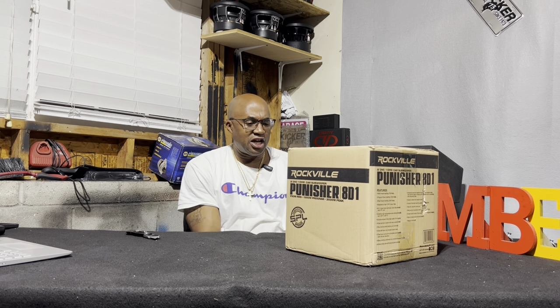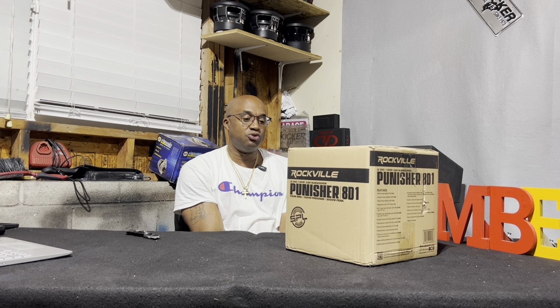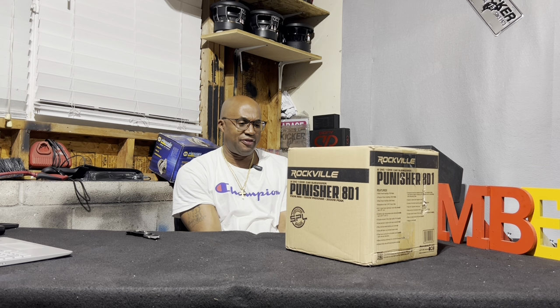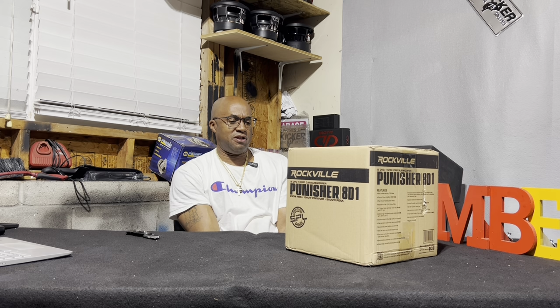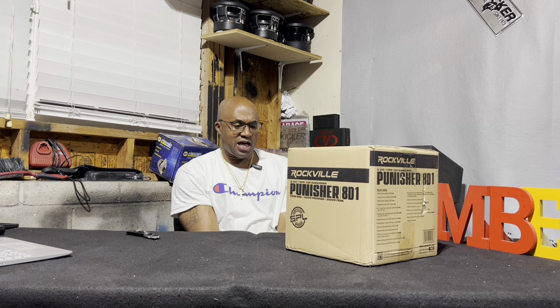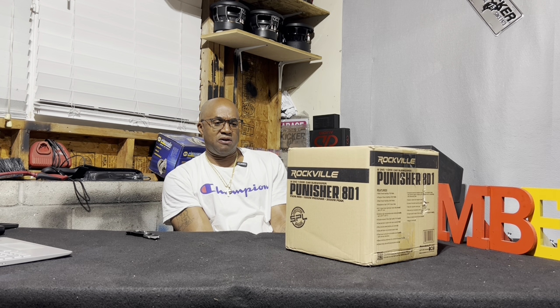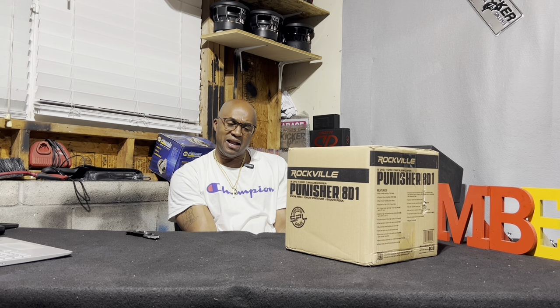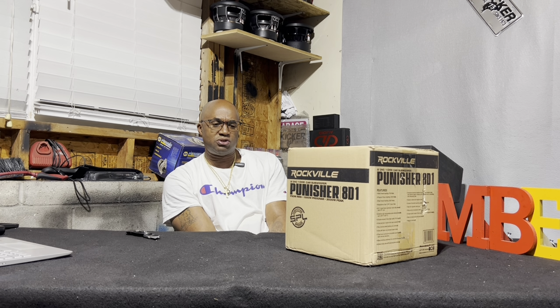Can't answer that. It has double stack 145-ounce high quality Y35 magnets. That's the industry standard. Everyone's using Y35 or Y30 for the most part. A 0.9 millimeter thick ultra stiff polypropylene dust cap, which means it has a plastic dust cap. What else? High BL magnetic motor gap. What do you mean high BL because of a tight magnetic motor gap? I don't know, that's not really making any sense. Three-layer spider made of thick gauge material to resist tearing.